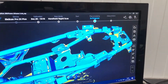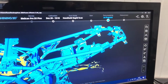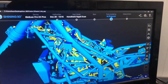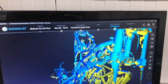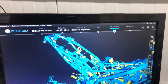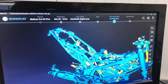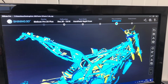What I do need, and which I have, are all the holes and all the alignment for a new body kit. I've scanned this at a little bit more raw resolution than the other parts, mainly because I can easily measure the sizes of the holes. I just need their locations, and I'm using the scan as a reference to design the frame. So I'm not using this scan as the exact thing that I'm reverse engineering the new body kit off.